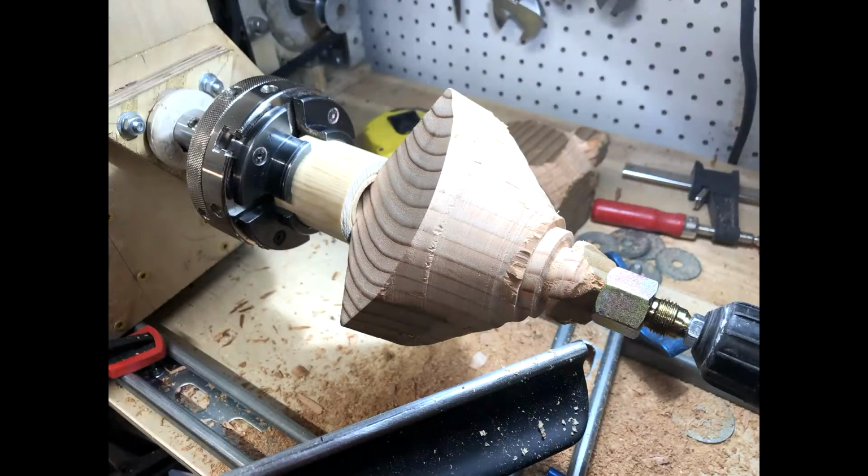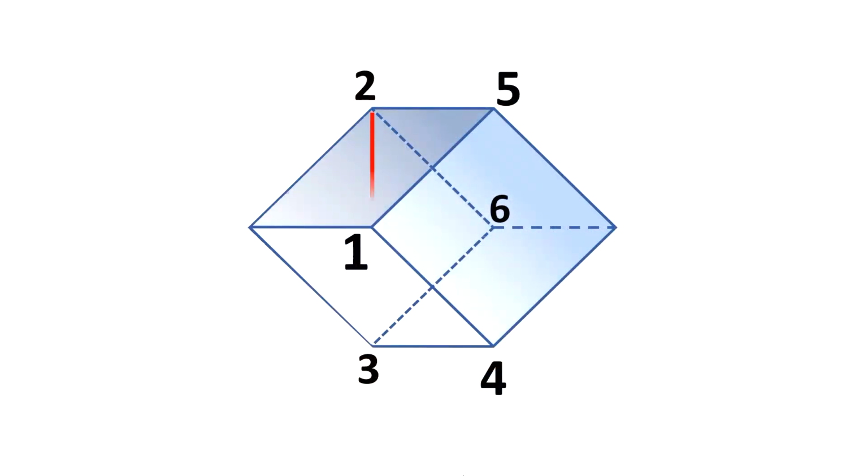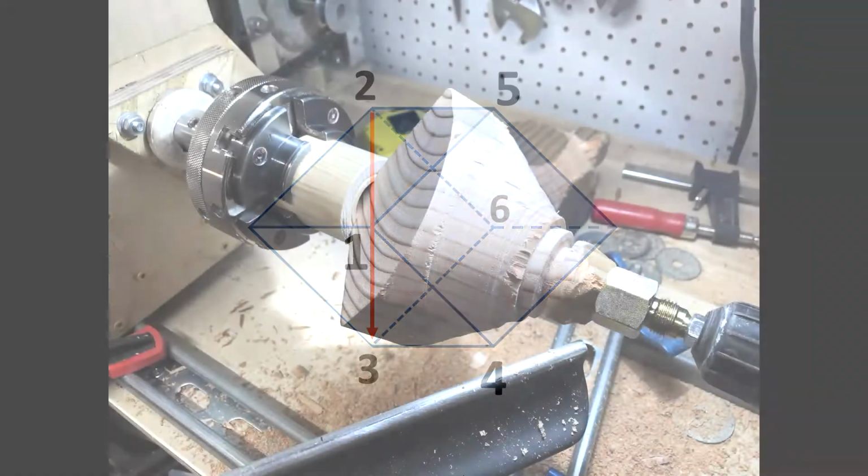You can't use a worm screw in your chuck, and it's difficult to mount it like a spindle between pointed centers. I used 2 DIY hollow end cup centers to hold the corners of the cube, which then was driven by friction at the headstock. You want to line up the free corners of the cube to rotate as closely as possible in a plane so that the final peaks of the bowl's edge are of equal height.